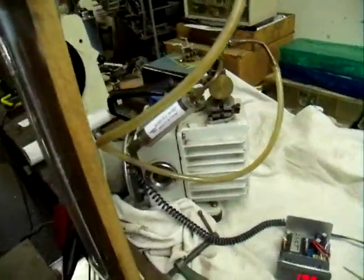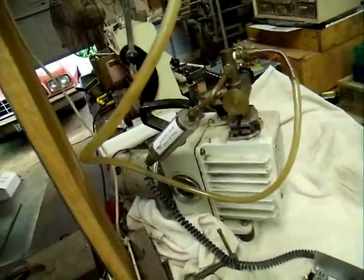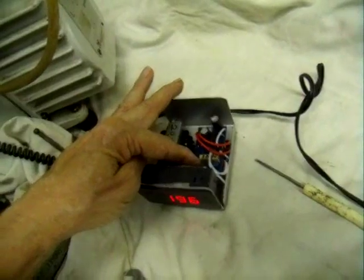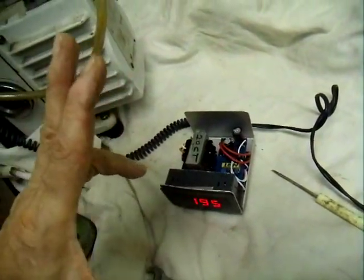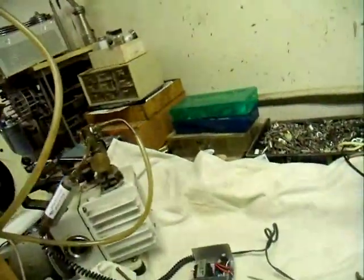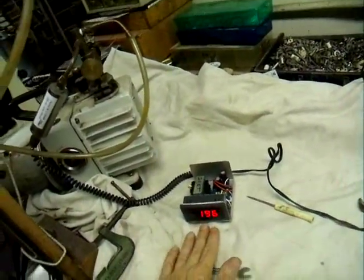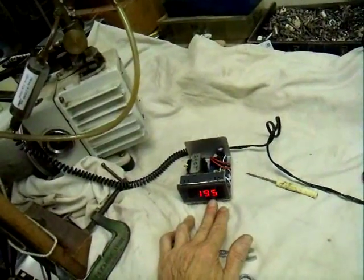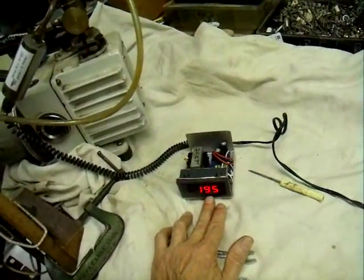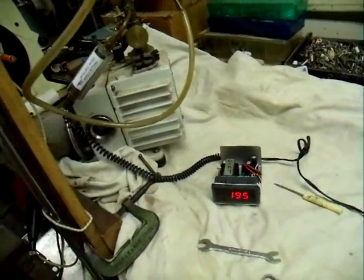That's how you would calibrate a gauge. You could do this same thing with a Pirani gauge or a thermocouple gauge — make a circuit with a zero adjust and a full-scale adjust, go between two points on your U-tube manometer, set the full scale for the maximum and zero for the minimum. Even with a thermocouple gauge over a range of 100 torr, you could get it to read within one or two digits, which would be completely satisfactory for Nixie tube work.